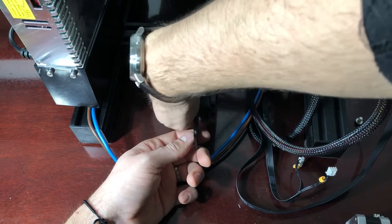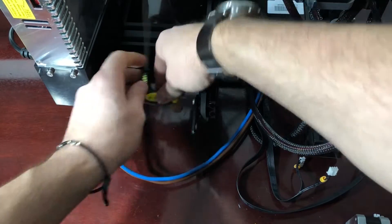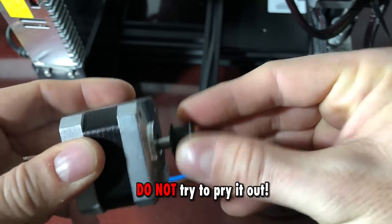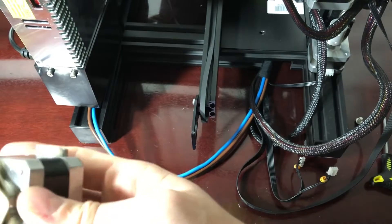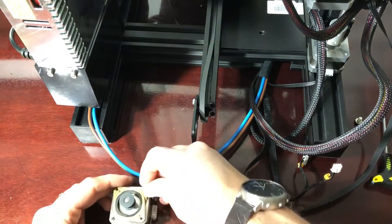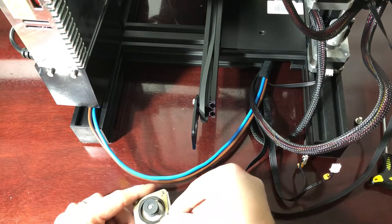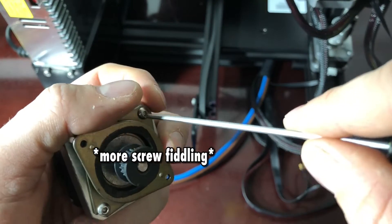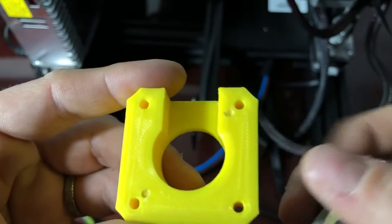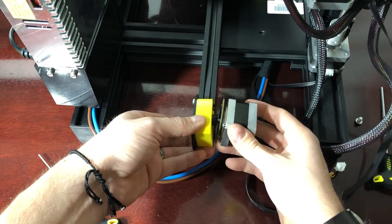Now we go on reassembling the bracket. As you can see, the bracket has been reassembled on the other side of the Y-axis extrusion and we are putting it back with the original screws. The next step is to fit the damper on the motor itself, reusing the small screws. Be gentle with the screws because the head is very small and the hexagon is quite delicate — if you use the ball end of the allen key you risk damaging them. I printed out the support and had to drill two small holes to account for the two small button parts that protrude from the damper.